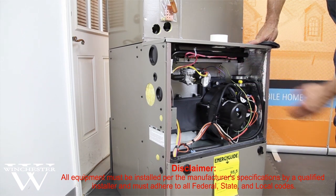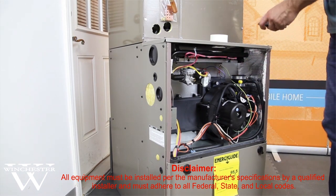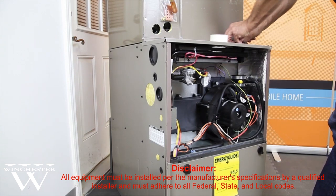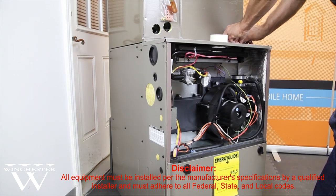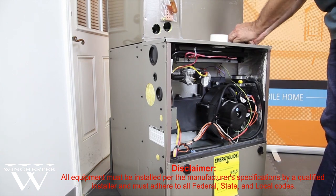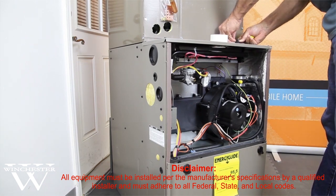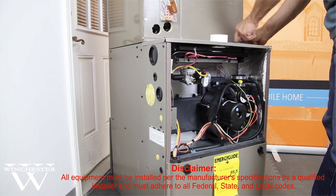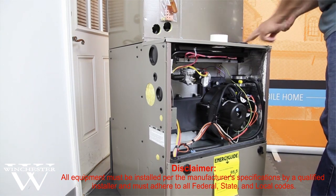This is where your flue gases flow out of the furnace when it's operating in heat mode. Simply push the gasket in, make sure it's seated properly, and then you can place the pipe down inside through the vent motor. These gaskets help to contain the noise of the furnace so that when it's operating, it is a very quiet operating unit.